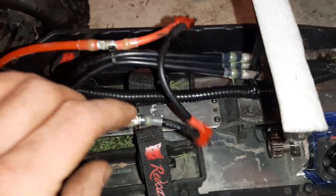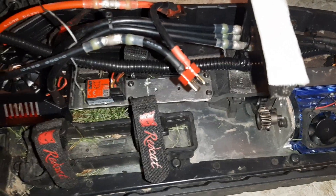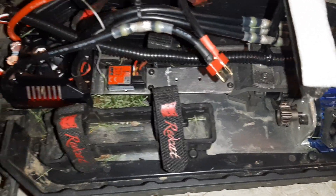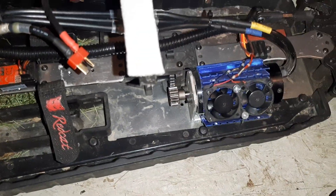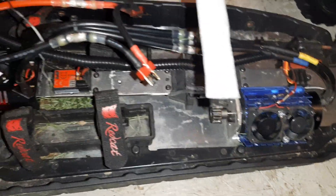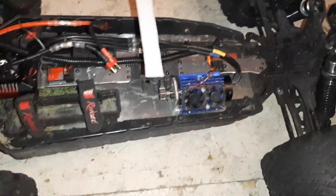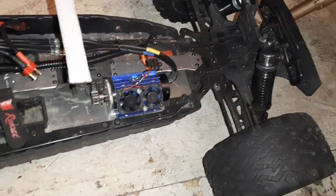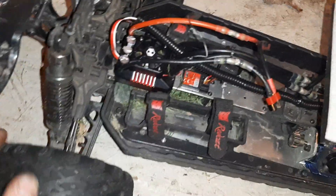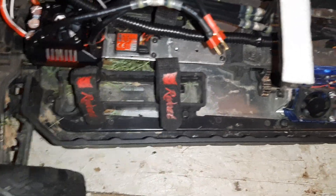If you guys have any questions, I am going to be doing a few more things to this truck — differential lube inside of there. I want to put some 1 million K in there to help keep the front tires from ballooning and put a little more power to the rear. I'm going to do 100 weight in the rear shocks and 90 up front. When I get done with this other video, you guys will see all the stuff I'm upgrading and I'll go ahead and do a tutorial on how to take it apart. Get a hold of me if you have any questions. Thank you very much for watching my channel.